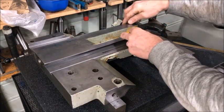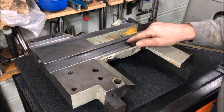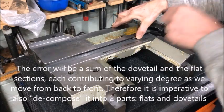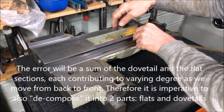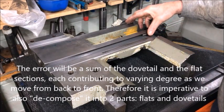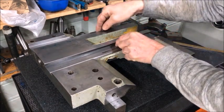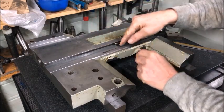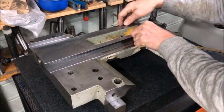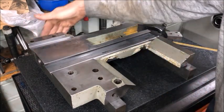After finding and verifying the references, I use the setup to measure with pins. I call this a compound measurement because the wear is present both in the dovetail section and in the flat. Toward the end, most of the wear is in the dovetail section, I think. When I move from the end toward the middle, I'm measuring the wear in the flats, which we've also confirmed with bluing. When I move back to either end, the reading reflects mostly the wear from the dovetail section.